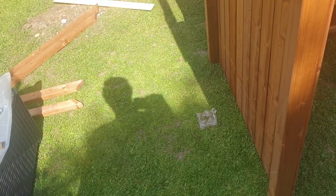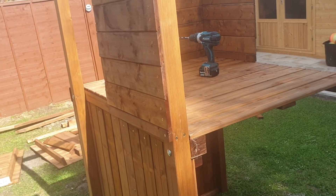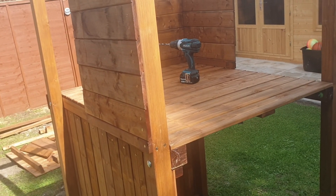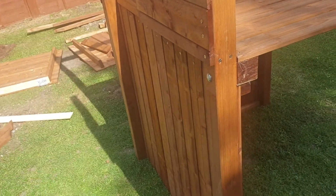We were recalled on a 'can you go back and look at it' sort of scenario. We went back and it was exactly as per instructions, but the whole thing was twisting. So we took off the lower den and the cabin with the vertical poles and slatted it across, actually putting in some diagonals.